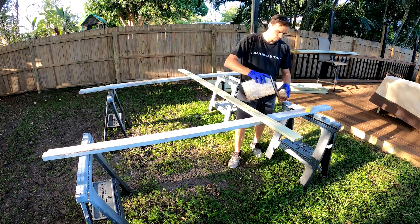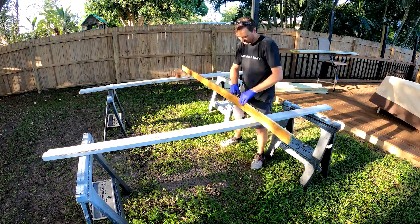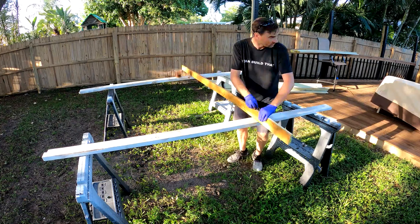Putting in a slat wall fence is a fairly simple DIY job that you can usually complete in a weekend. When you start your project you have to decide whether you want to stain the wood before it's up or after, and I'd always recommend staining your boards before you put them up — it's much easier.